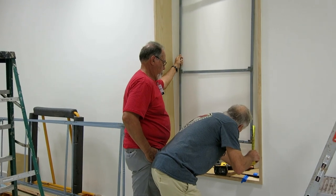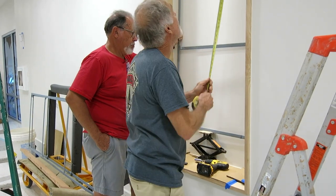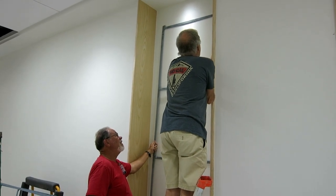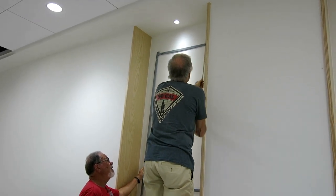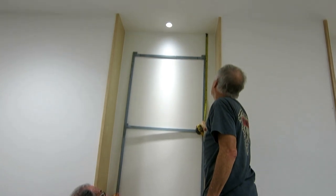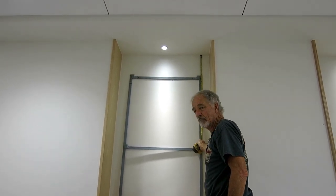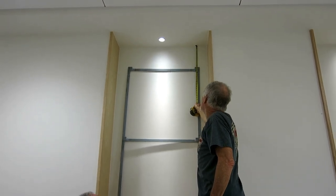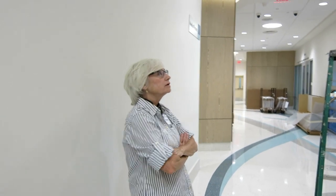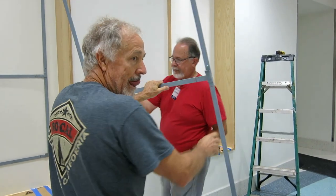I made the hanging frames and I made the embed frame that's in the back of the sculpture — the relief. Even though I tried, they're not exactly the same, so I numbered them. Before we pulled the relief out of the mold, I put the frame in place and measured back from the sculpture six inches all the way around, and put a sharpie mark on the wall frame. So wherever we hang the wall frame, the finished part you see will be six inches from the sharpie mark. That made this a lot easier. The first decision was how high in the niche to place the art.